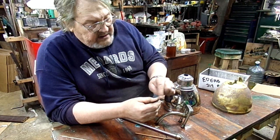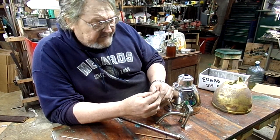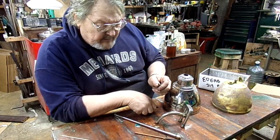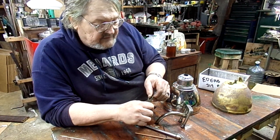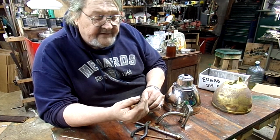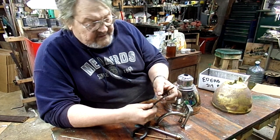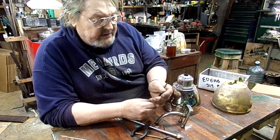You can clear these by soaking them in Sea Foam, heating them up real hot, burning off the carbon or whatever. I've had a number of guys say 'I can't get the tip clear — it's garbage, I'm going to have to go to Coleman Parts and buy a repro.' But here's something I don't know if a lot of guys know: this little nut screws off — this is the orifice nut. If it's clogged past the point you can clear it, the nut on the 220, 228, and all that is the same thread size. So you pick these up for a couple bucks as opposed to 30 bucks. You can unscrew your nut, put it in there, get it good and tight, and you're good to go.